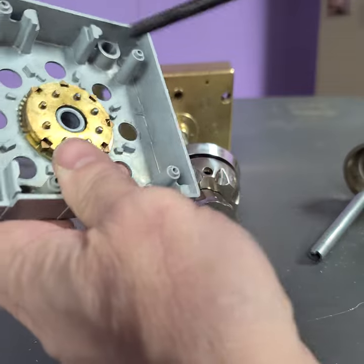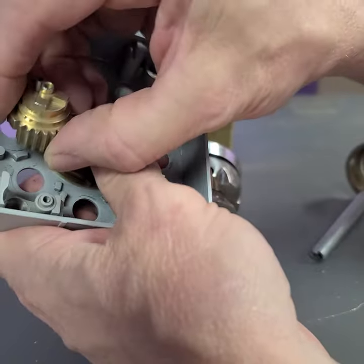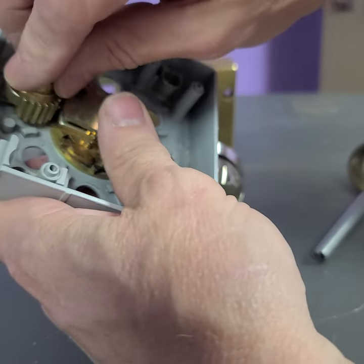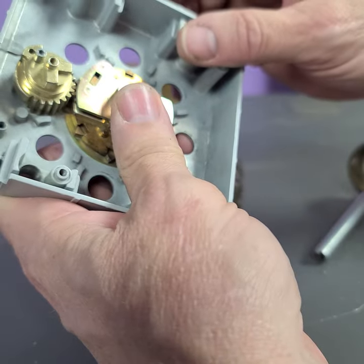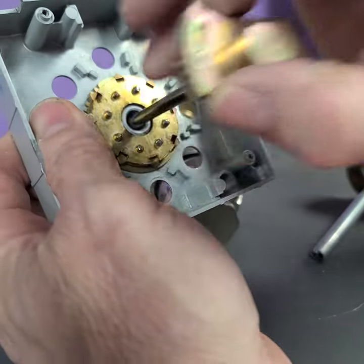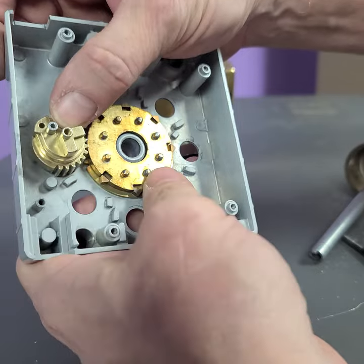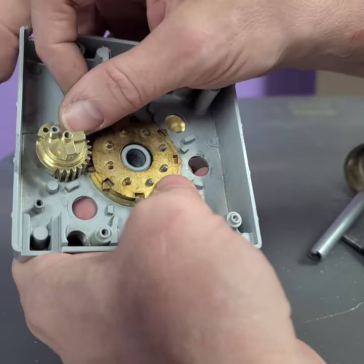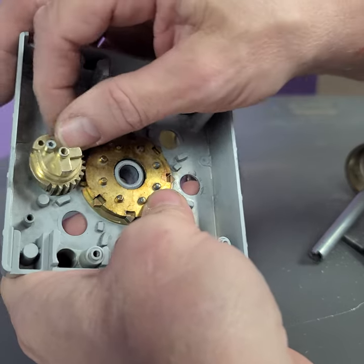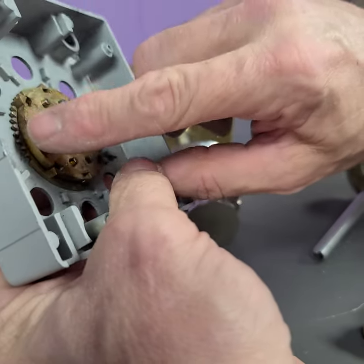When you are in the position to throw the bolt, there's this part right here that's one piece that it goes against, and you're turning it. But importantly, you're also, through that, turning a small part underneath here that I can't show you because you have to take rivets. You have to physically destroy it to get to them. But you're also turning this little gear down here.